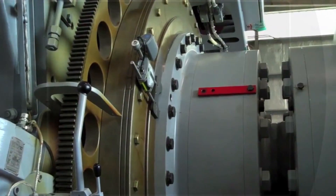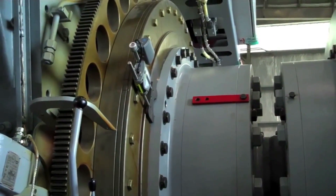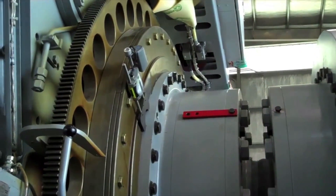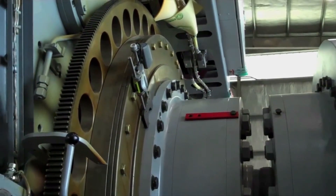If you're out of alignment in either plane, rotate the shafts to the appropriate position, switch the XA to live mode, and make your readjustment again while watching the live readings.